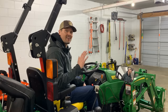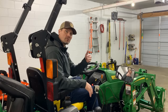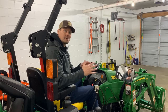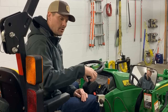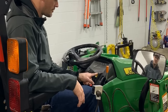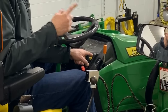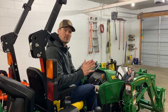The first feature we're going to talk about is the RIO — the reverse override. What that feature allows you to do is mow backwards. So if you want to mow real tight and trim to a tree, safety first, make sure you're looking behind you, and follow your manual. The reverse override is made for those mid-mount mowers and is found on a lot of different models. You might have a pull-type knob, or a version like this little yellow button that you push up to turn on the mower deck.